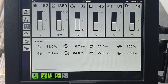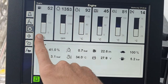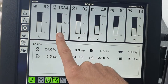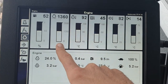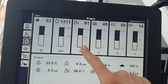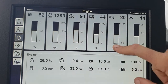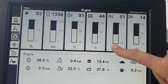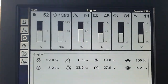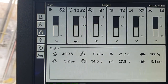Moving to our next screen — this one is pretty self-explanatory. We have a fuel gauge and engine RPM. The rig holds about a 300 to 400 liter fuel tank. The engine is a Caterpillar C9 — a nine-litre straight-six fully turbocharged diesel. Then we have coolant temperature, hydraulic oil temperature, compressor temperature — we blow air down the hole constantly while drilling so we have an onboard compressor — and outside air temperature, a refreshing 14 degrees today.